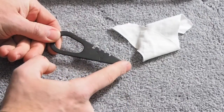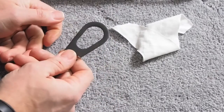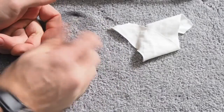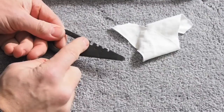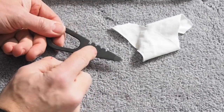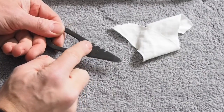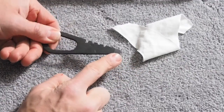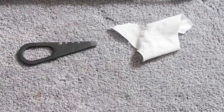4 different uses, okay? This large hole right here basically fits over your actual bayonet, and it gives you extra leverage to turn your bayonet on and off your rifle. This large slot, of course, you just saw us use it to tighten up our jag. And then you have your 3 notches here to check for firing pin protrusion. And then lastly, you have your actual slotted type screwdriver tip for disassembling your rifle.